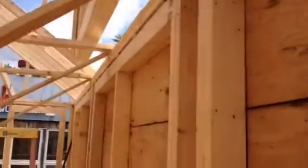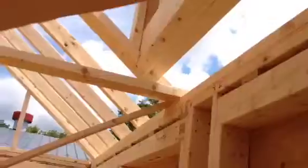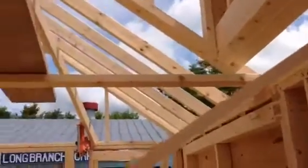And to straighten the wall, we ran this line and we racked the wall out just a little bit and then installed these 1-bys, nailed and screwed in, and then using this line, we put a block underneath it and we sucked it in until it was straight with these pieces. We banged them in until we had the same distance on that line all the way across. And you see we have 3 of them in here. So that kept the wall straight, and then we brought the next wall straight using these cross members, these 2x4s.